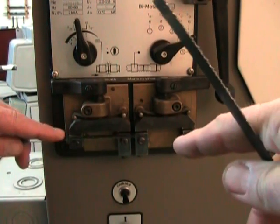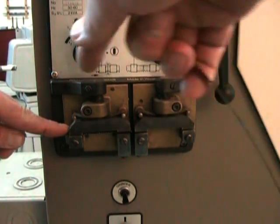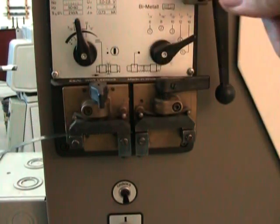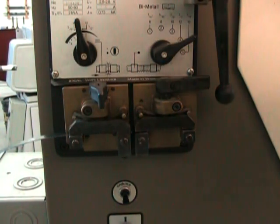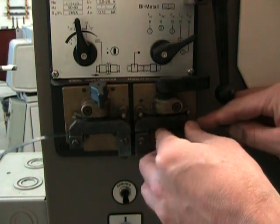With the blade's teeth pointing towards me and trying to center as best as possible the eventual gap between the two ends of this cut bandsaw blade, I'm going to install the blade in the jaws and snug it down tightly.